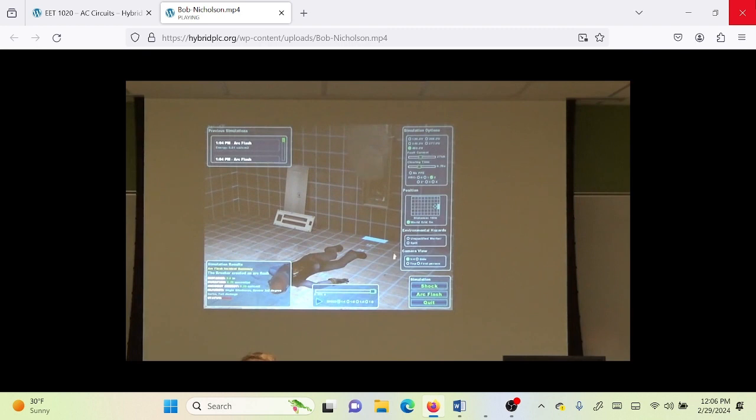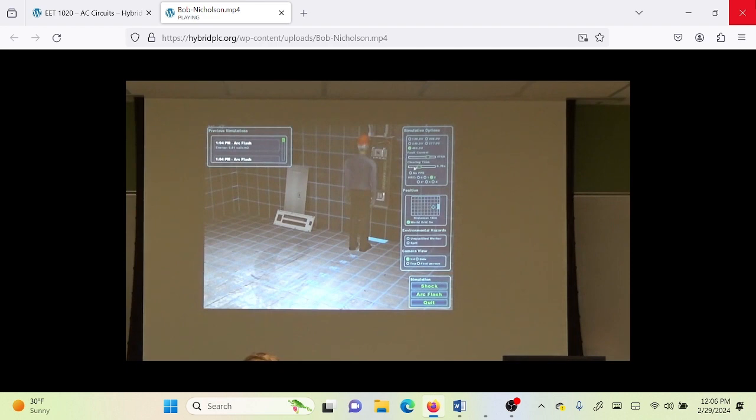All right, now I'll make some other points here. I'm going to pull this guy back. He's got a long life. Okay. I'm going to turn this energy up. And now you know what this is. That's fault current. That's from the transformer. That's how long the upstream device is going to take to trip. I'm going to put heavier clothing on the guy.